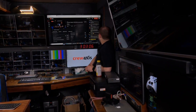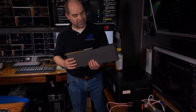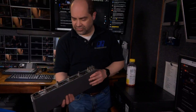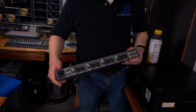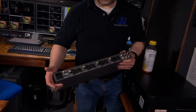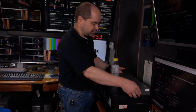On top of the printer here is one of the Blackmagic Design Studio Converters — these are the fiber conversion units. You have fiber connections from the cameras, and you can get the video back out as an SDI output plus audio outputs for each of the four channels. It also provides intercom — bi-directional video, intercom, and tally all through one unit. I intend to put this in my fly pack for my smaller switcher but just haven't done it yet.